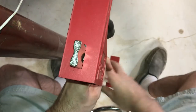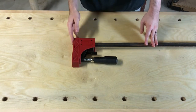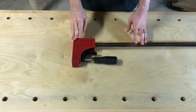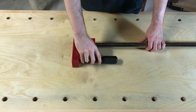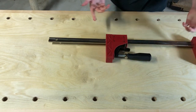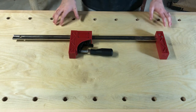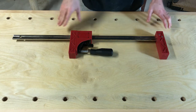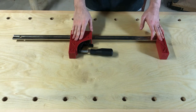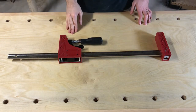Once you have the movable jaw in its reverse configuration and the bar fished through all five rectangular openings, all you have to do is depress that lever, wiggle the handle like you normally would, and slide it right over the bar — just like normal, except backwards. Now you can enjoy your Jet parallel clamp as a spreader. If you didn't know you could do this at all, enjoy — and if you knew but were struggling with it, hopefully now you can make this conversion a lot more easily going forward. Thanks for watching.